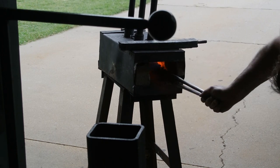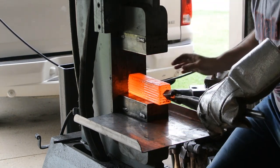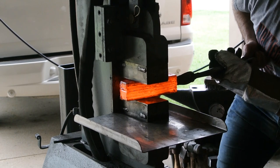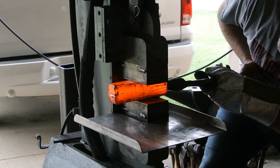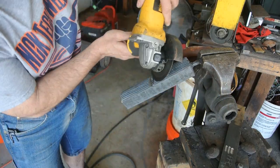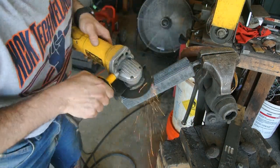Now that the forge is hot, here it goes. To get her up to temperature, we're going to go ahead and set those welds with a press. You can see just a little bit of that steam coming off of that — it's not actually steam, by the way. Now that the welds are set between the layers, we're going to go ahead and cut the electric weld from the MIG welder off. That keeps us from having any mild steel in the billet once we get everything drawn out to the length that we want.